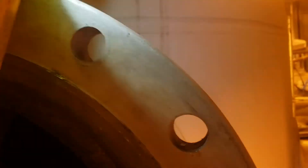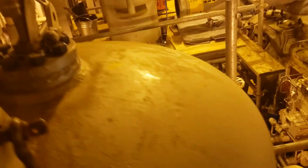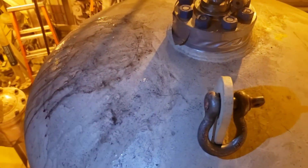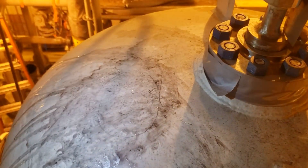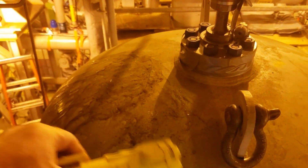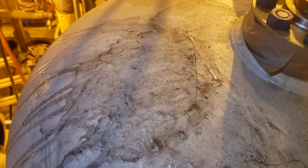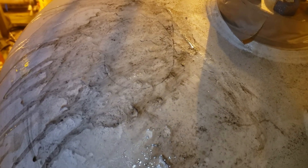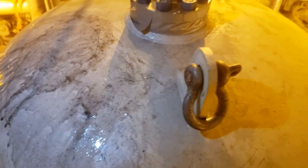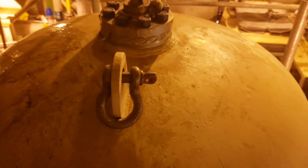There's the outlet nozzle — top head. See this area right here? I had the UT Tech scan this whole area, about two square feet. I wanted to do a bunch of scanning to see if we could find corrosion in the area directly opposite the coating holiday. And of course I'm not seeing any accelerated corrosion — I just wanted to make sure. The rest of the surface looks pretty good. No surprise — it's lived its entire life inside.